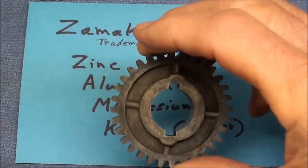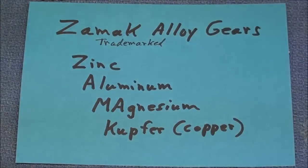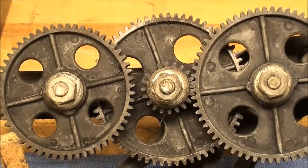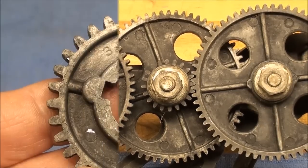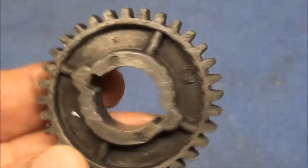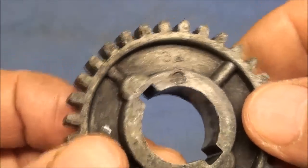I don't think they're as tough as cast iron or steel, but I think that's how Sears was able to sell things cheaper — made differently, not necessarily poorly made. You can see the ejector marks on the larger gears as well, and they put holes in there to save material. This is the gear I'm going to duplicate — it's a 32-tooth. I'm not going to put the recesses in. Notice the hub is a little thicker than the gear itself, and there are two keyways in there; I'm only going to put one in.